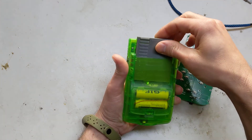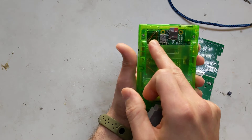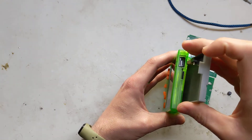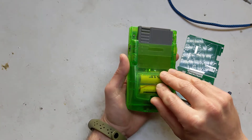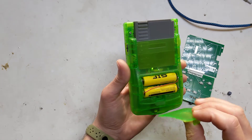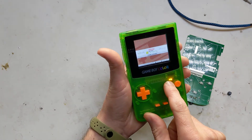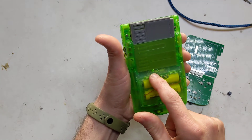I had to make this 3D printed fake game cartridge to go over the cut-out and some other stuff I removed. There was going to be an IR board but I couldn't get it to work, so I'm going to scrap it in my next one. I've got a little slot here for the SD card, but that's covered with this cartridge which has got a magnet in the case and a screw on the sides to keep it in place. The batteries just go in the same battery bay, but I've reused the springs in a different order and wound them up differently so you can put two LiPo cells in there. They are rechargeable - you can't put normal batteries in here, they will not work, just in case anyone was wondering. It's charged via the power bank board here, as you can see the indicators. That's kind of why I went with the see-through case - to see the battery indicators and to see the Raspberry Pi activity light so you know when to do the shutdown.